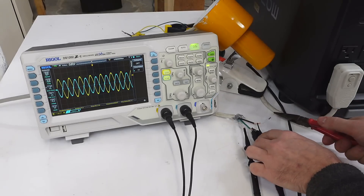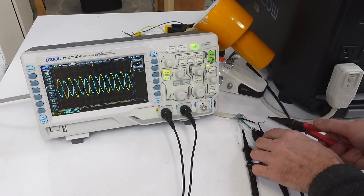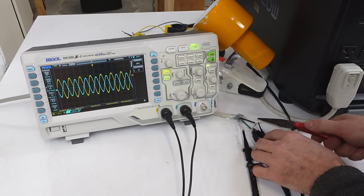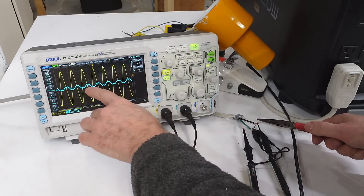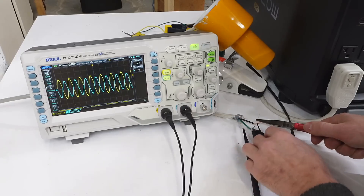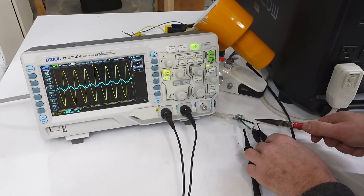Let's try a 47 kilohm resistor between ground and the black side. That already moves it almost all the way over, so the blue phase has just a little bit of voltage left on it. So if I accidentally touched ground and hot with my fingers, it shouldn't seriously zap me. But my name's not Mehdi, so I won't try this.